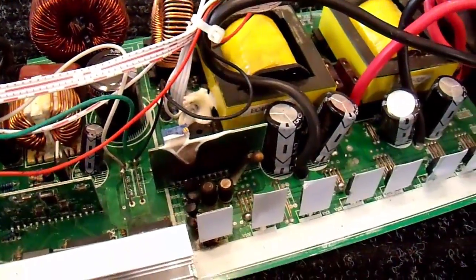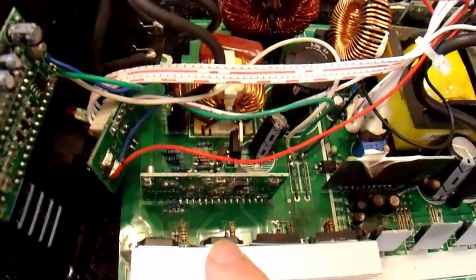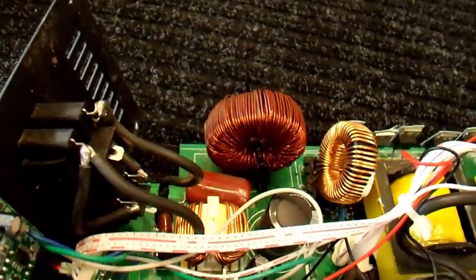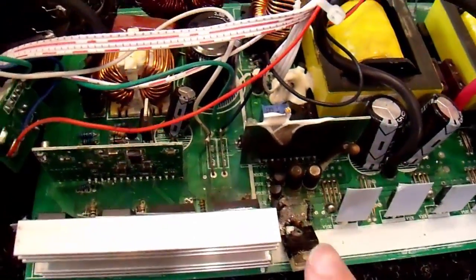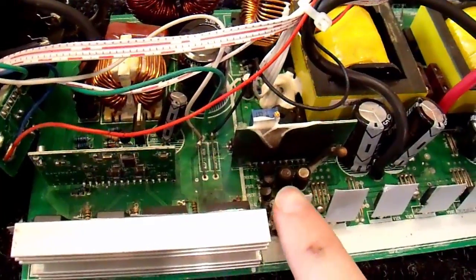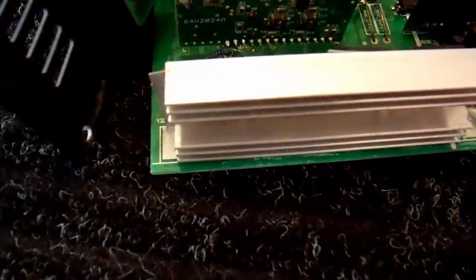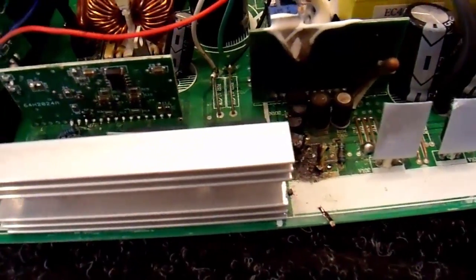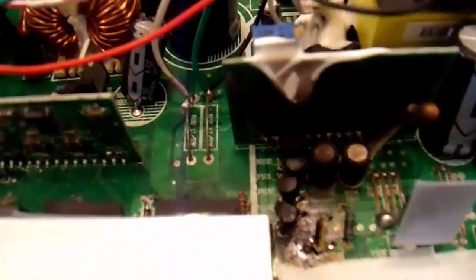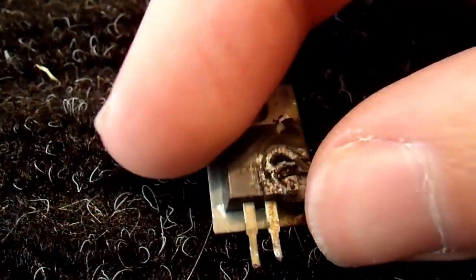When I got this inverter, I'm pretty sure there were a couple of transistors on the output stage that had to be replaced, and this inductor had broken off from the board, so I re-soldered that on. Now this particular FET here is completely blown up, so I know that's bad — I'm just going to cut it out and remove it. I want to see what else on the circuit board, component-wise, might be damaged. There's the burnt-up FET — nasty.